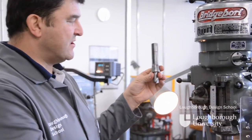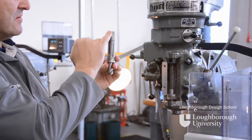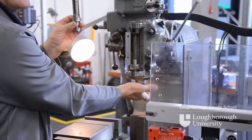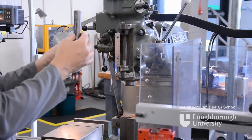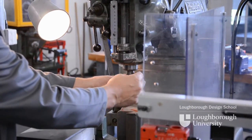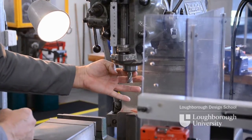To load the collet into position, the collets have a keyway milled in the side. This has to be in line with a drive dog which is on the inside lip of your spindle nose. If the keyway is not in line then it won't go all the way home. So find the drive dog and it should slide up and go all the way home.